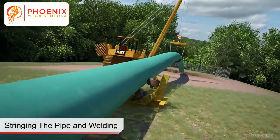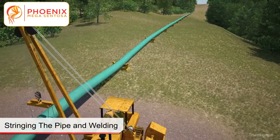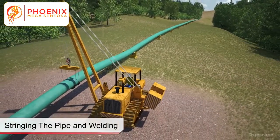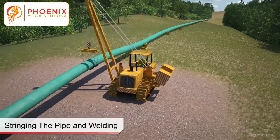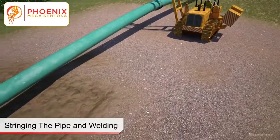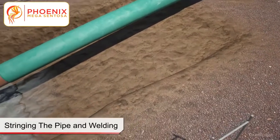The rollers and slings used in conjunction with the lifting equipment not only provide support for the fully fabricated pipe string, but also help reduce the amount of friction acting on the section of pipe above ground, reducing the overall amount of force required to pull the product pipe into the bore. The rollers and equipment are also used to position the product pipe to match the angle of the bore where the pipe enters the ground surface.